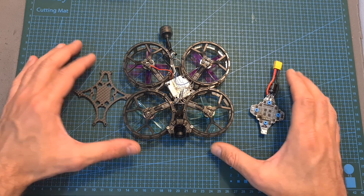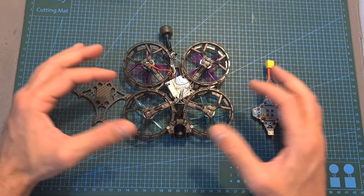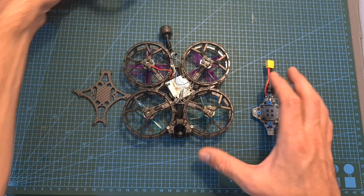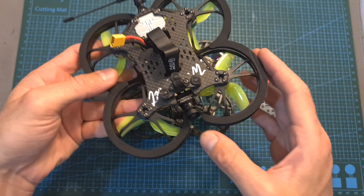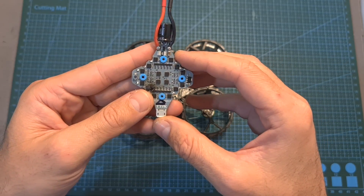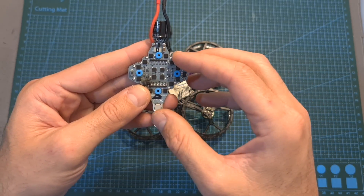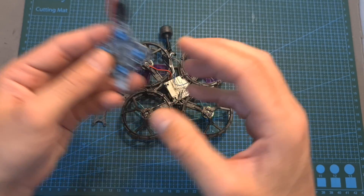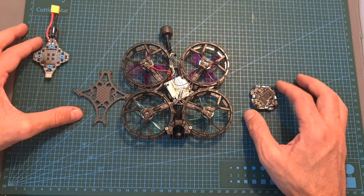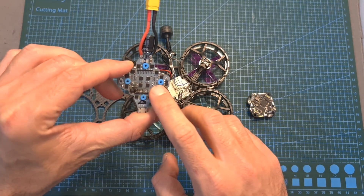My conclusion is that if you're going to stick to 3S batteries, the Micron is probably a good option for flying indoors. However, if you're mostly going to fly outdoors, the Wingsuit is going to be a better option as it fully supports 4S batteries and will provide more flight time. One more point: because Home FPV wanted to keep the form factor down, they're using a custom all-in-one flight controller by Transtech, and due to the structure of the frame, it will be hard to replace it with other 20x20 AIO-style controllers. Keep in mind that if things go wrong, you will need to get this exact board.